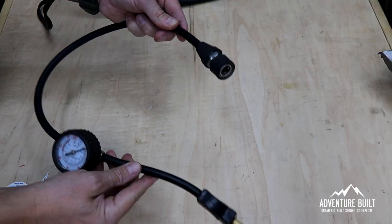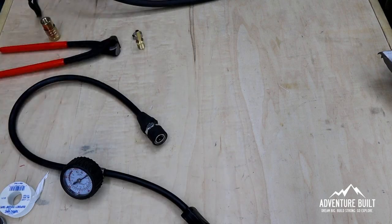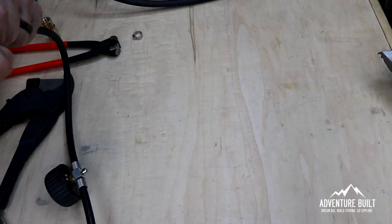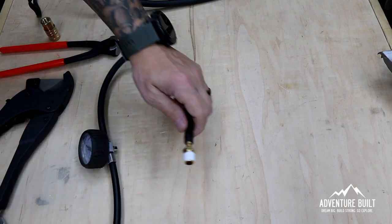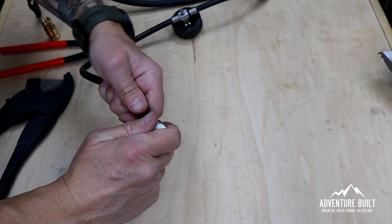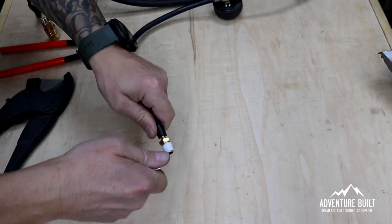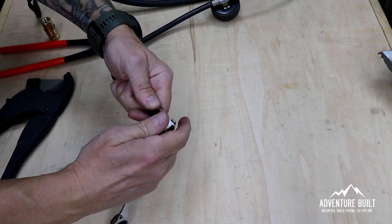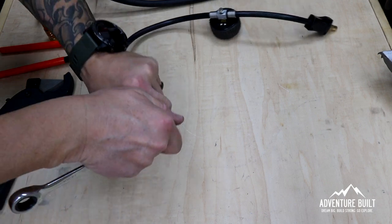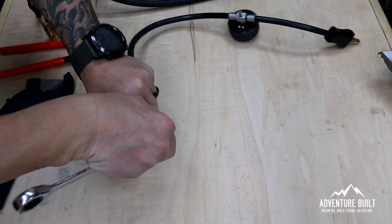I know you might think this is weird, but I really like this hose attachment with the single-point valve and the gauge right here. So I'm going to cut this off and make myself another regular female-end attachment so I can still use it and keep it as a spare. All I'm doing here is using the wrench to give me some leverage so I can spin it, then using my hand to push it down as I spin it. I sprayed it with a little bit of Windex to give it just a little lubrication to get it in. It's going in just slowly — this again is just going to be a backup I'm going to leave in my toolkit, because you never know.